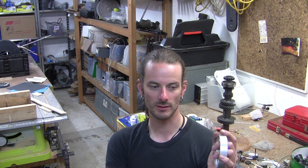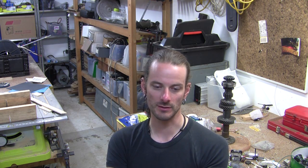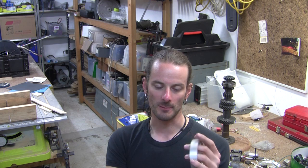I couldn't turn this pulley with the lathe as it was, but after the modifications I could do this quite easily. In fact, the last set of videos I did with the back plate — I don't think you'd be able to do that turning without this modification. This allows you to turn a part that will just clear the cross slide.